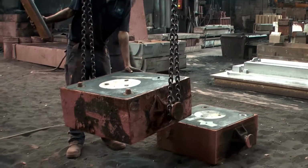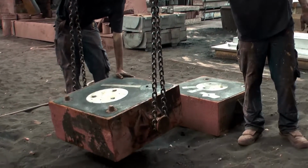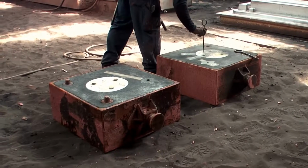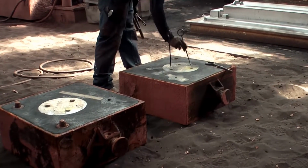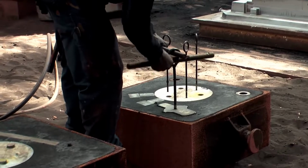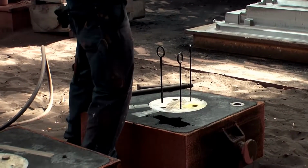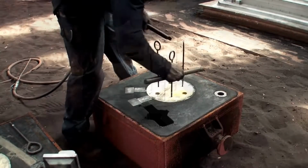The two protruding knobs that are visible on the top part are there to interlock the two parts in the right position. So that's the moment when my threaded inserts in the model become important. 3 hooks are screwed into them, and with carefully knocking upwards, the pattern will eventually come loose. Of course, the pattern has to have no undercuts, and the vertical surfaces need to be slightly tapered.